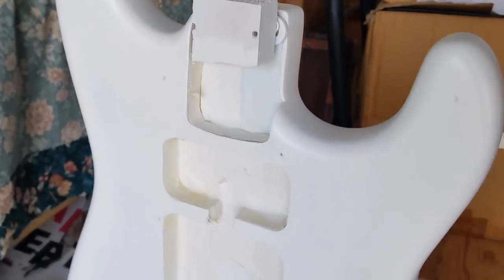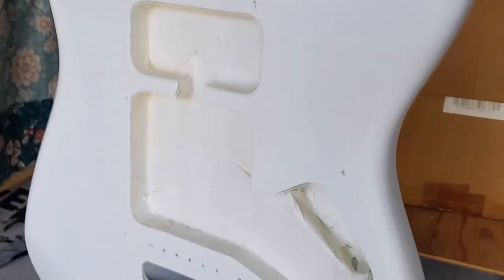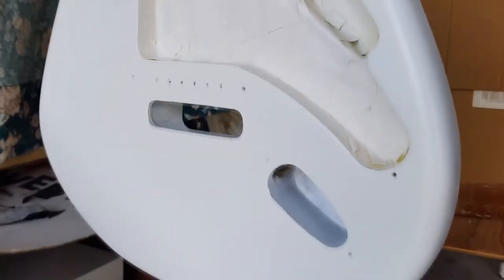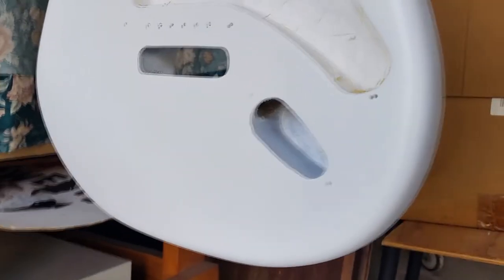The fact of the matter is that I was always going to be able to leave a thumbnail mark, but I think it did get to an acceptable level of hardness to the point where you could call it dry enough to proceed with the next step. You are not really going to be able to tell from these shots how it would turn out, but this paint turned out to be very matte and felt a bit chalky to the touch when it dried.